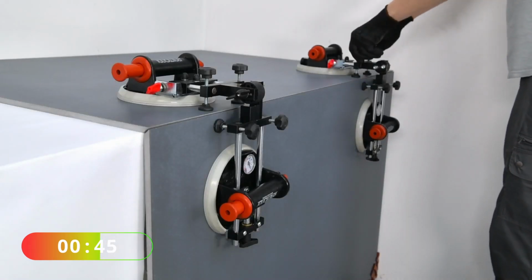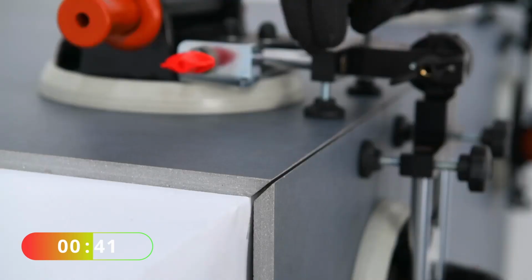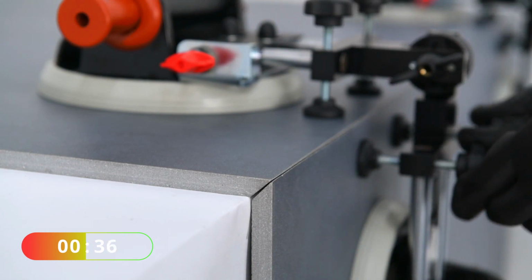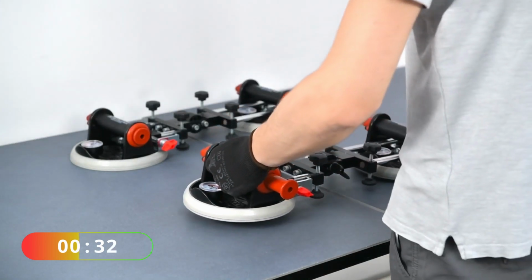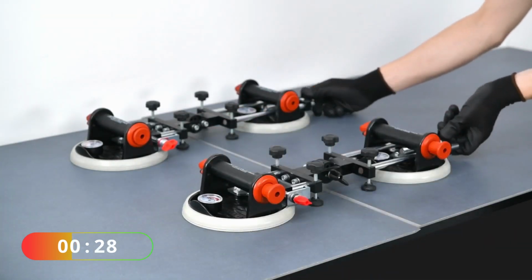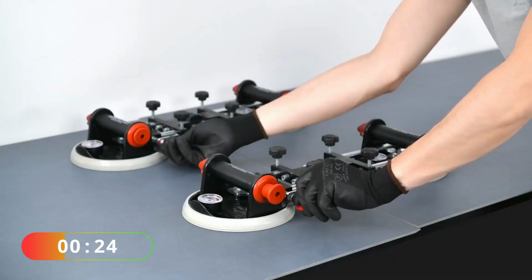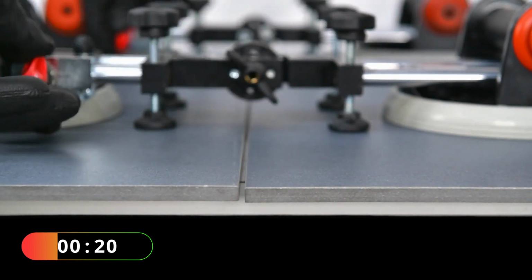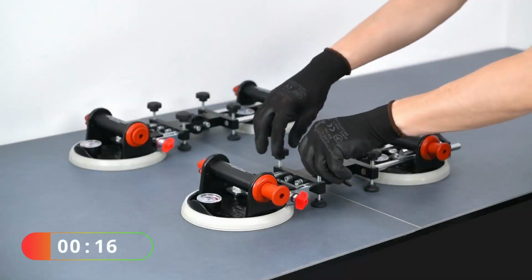The perfect flatness of the countertop section is achieved thanks to the vertical adjustment of the 4 feet. All adjustments can be achieved either on slabs horizontally or vertically. Thanks to the vacuum device, the grip can be restored without removing the suction cups from the slab, to grant a consistent support during the maturing of a bonding agent.